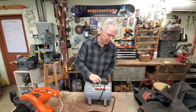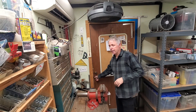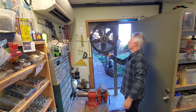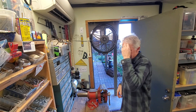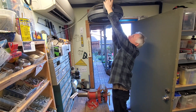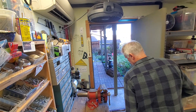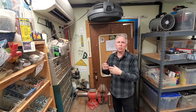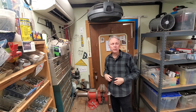A lot quieter, and I think I found a location for this thing. In the past I do all my work here — if I want to get some ventilation going, I'd use a fan about two feet away from my weld area, work area, cutting area, just blowing out. It works okay, but I think an area where I can put a duct just inches away from my work area where I'm cutting, grinding, and welding will be much better to suck all that crap out outdoors.